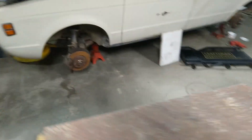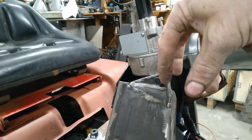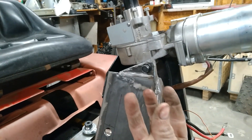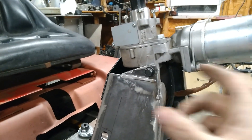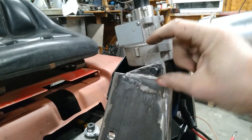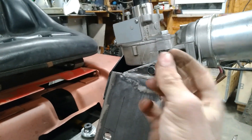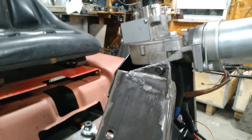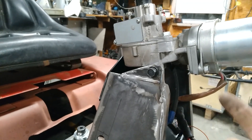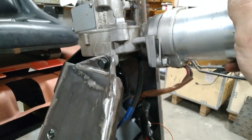There's a little controller for this thing. Inside the steering unit there's a coupling — think of it like a Lovejoy connection, with little spiders coming one way and opposing spiders the other way, with a piece of rubber in the middle. There's a sensor between the two spiders; whenever you turn the wheel the rubber compresses slightly, the sensor notices the torque applied, and it sends power to the controller, which sends power to the motor to assist you.